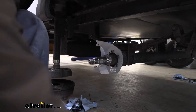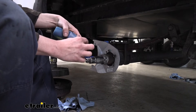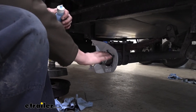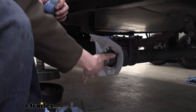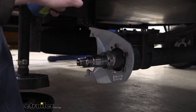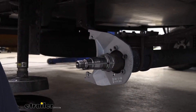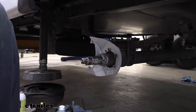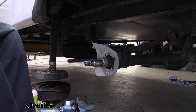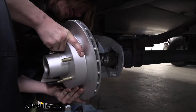So we've got all our parts prepared. Before I grab the rotor assembly, I'm going to put just a dab of oil on my finger and put just a little bit here on the spindle. This will help the parts slide together a little bit easier. Some of these newer parts have such tight tolerance that if it's ever so slightly cocked, you can get into a binding situation - so this just helps minimize that. Now we're going to grab our assembly and slide it into place. You want to be careful when sliding it in - we don't want to nick the seal on anything. We're going to try to be very careful to line up the hole and slide it in.